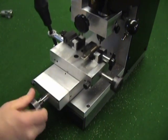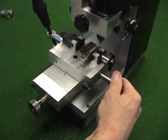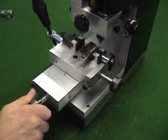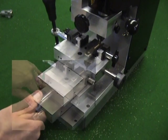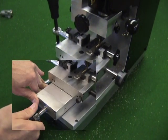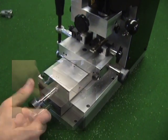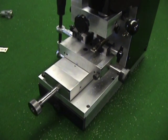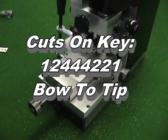Turn the depth rod to the shallowest depth, in this case a number 1. The space rod has a detent in the key load position about 1 inch away from the cutter and guide. With the depth set for a number 1 cut, turn on the machine and turn the space cam to move the key into the cutter. With our number 1 cuts already made, the cutter should ride up the channel cut with our setup key. We recommend using your left hand to help the carriage move into the cutter as you position it. It is normal to remove a small amount of material as the key goes towards the bow. Stop turning the space cam once you reach the first cut at the bow. The cuts on our sample key will be 1, 2, 4, 4, 4, 2, 2, 1.